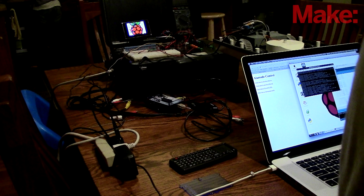My first step is to connect everything up the way I need it — the power converters, the Raspberry Pi, the Alamode, and the Arduino with its motor shield — also connecting the motor shield to the motors. I do this all on my table or lab bench and start playing with the software and programming to make sure everything is talking correctly. For power, I use my mobile prototyping kit to give me a solid 12 volts, then I can see how everything works together.